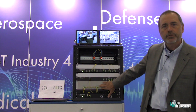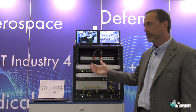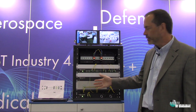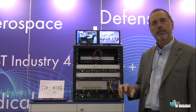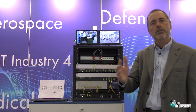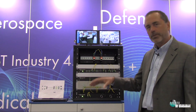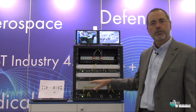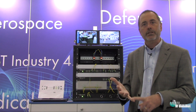Along the way, the optical switch here — we use these in data centers and digital applications, but it works equally well for this RF distribution of signals. The switch itself can be quite intelligent. It has the ability to monitor the incoming optical power, so you can remotely log in and see where the power is coming in and going out, and you can remotely do diagnostics on a system. It also allows you to remotely reconfigure the system. The optical switch was not designed as an RF switch, but it works very well as an RF switch with very low cross-talk at any frequency.